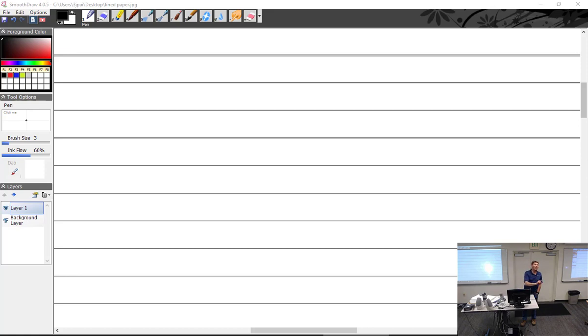As I move into composite propellers, they also have a metal tip on it. It's stainless or monel, similar to a wood prop. Don't file that. It's not supposed to be filed. It's like a sticker. So you can replace it, but don't file.